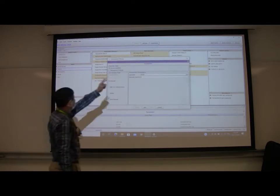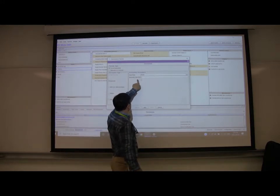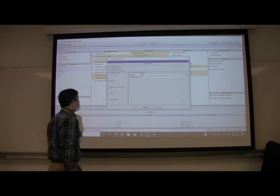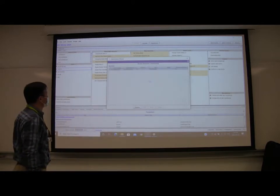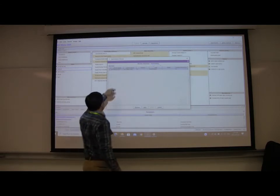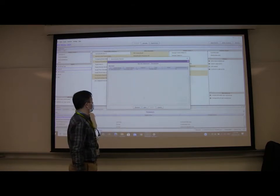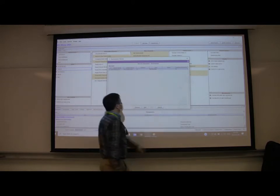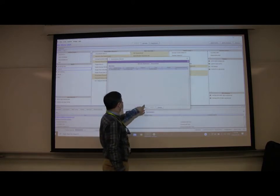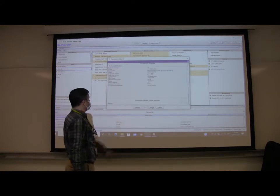We run the commission. So click it and then check this one. It's okay, and the computer is comport 8. It's okay. Then next. This is the controller we are using. This is a controller. The VAV box, winter 2021. The model number is FXPCV 1832. And then next. Yeah, finish.